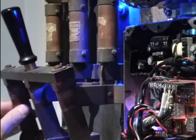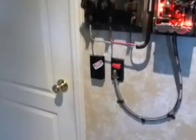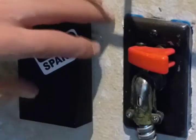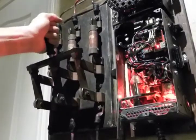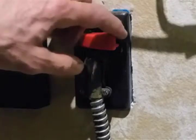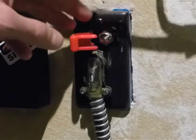Here's the touch sensitivity adjustment. Now let's take a look at the interface between my knife switch project and the home wiring. Here, I've still got my old dimmer switch in series with the knife switch working normally. This switch here bypasses the entire knife switch rig. It also reboots the Arduino in case there's a problem.